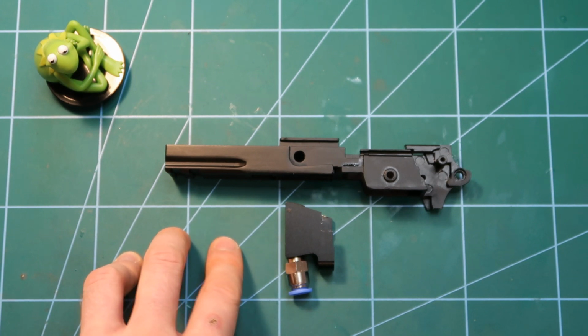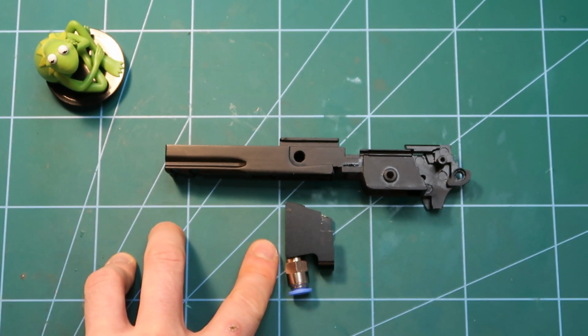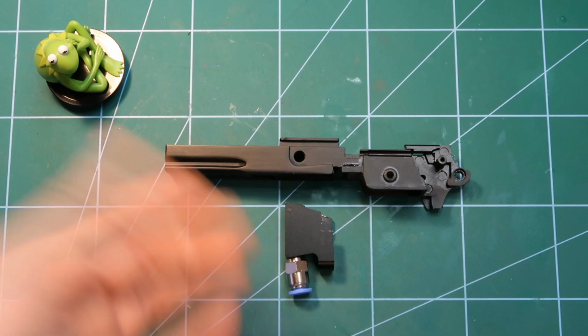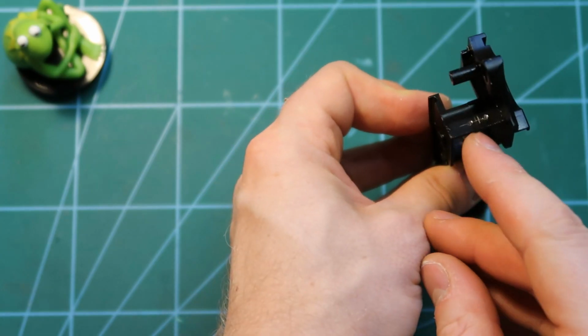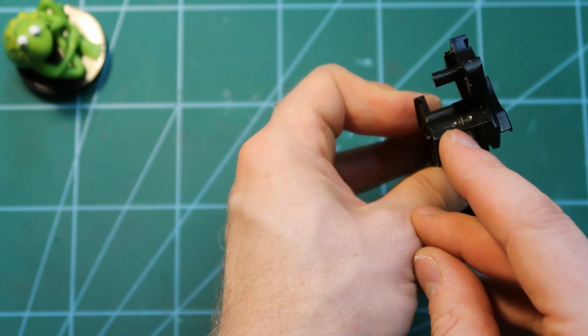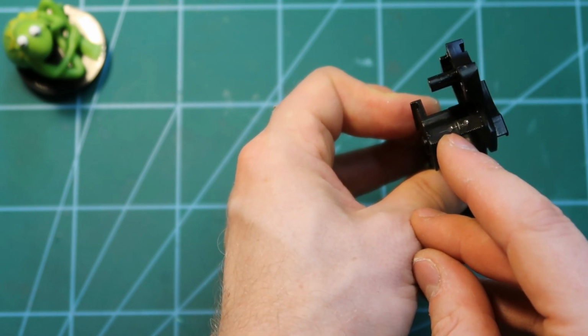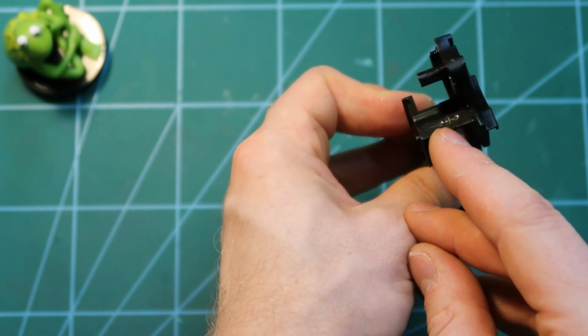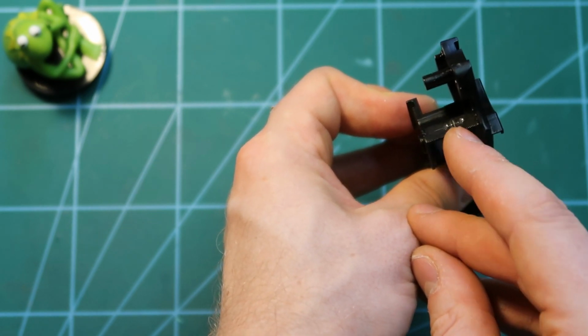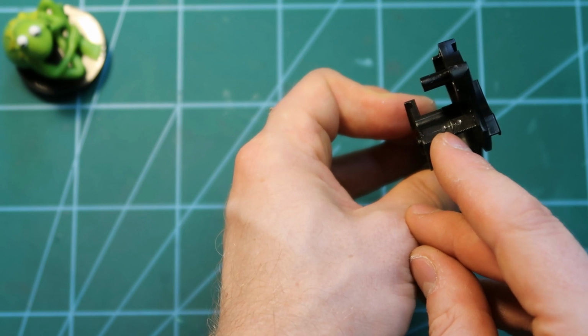So this is something that I will do off screen. I will drill first these smaller holes, then I will show them, and then I will enlarge them and show them again. You can probably see I have these holes in place, and actually this one ran out to the side by 0.3 millimeters. So I will need to correct it with the bigger size. This one is okay. This was a 1.5 diameter drill.